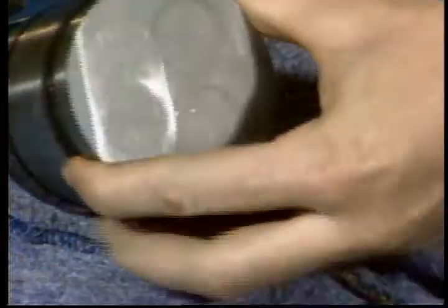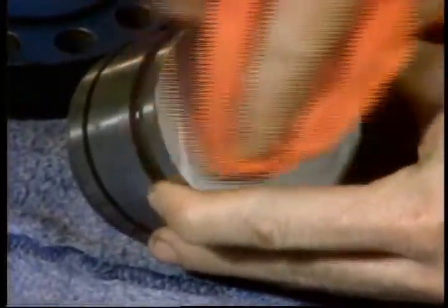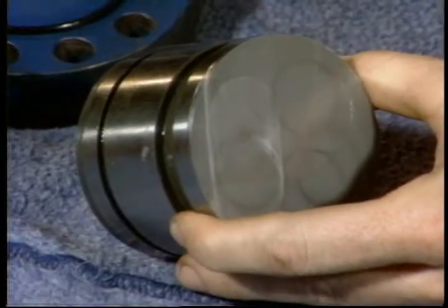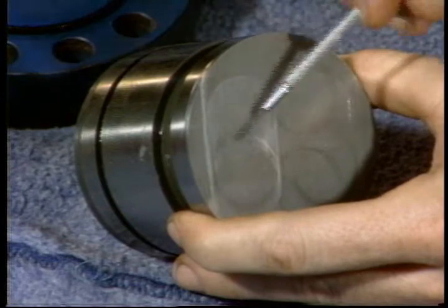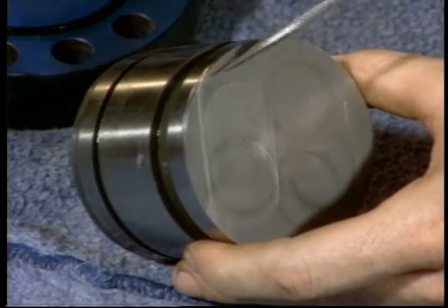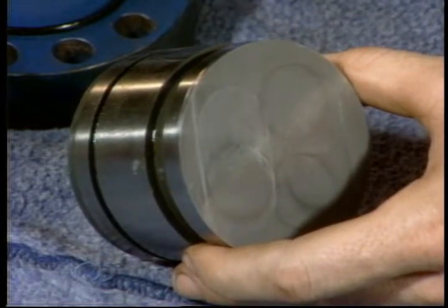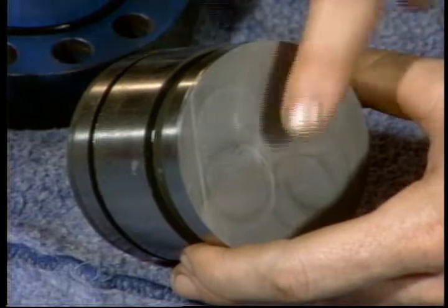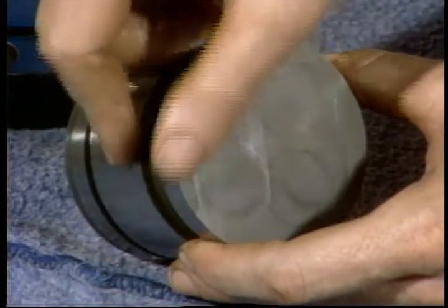The plates and flanges. Wipe off the seal plate surface and check these wear marks on both the seal plate and port plate. Even though the marks are very visible, the surface of the plate must still be smooth. If it's not, replace the plate and the seal rings. One note here. The plates are different sizes from the 3,000 psi to 5,000 psi valves, so they're not interchangeable.